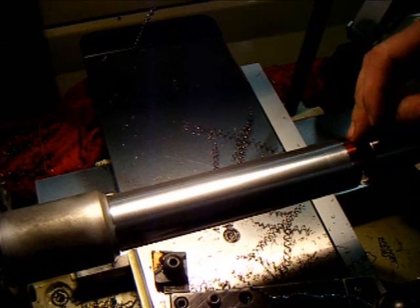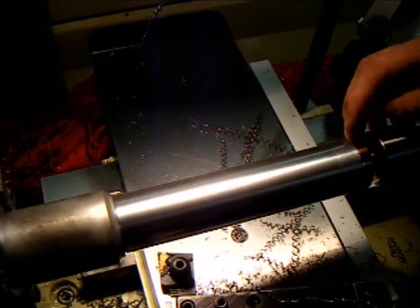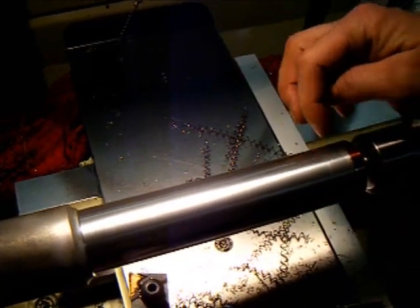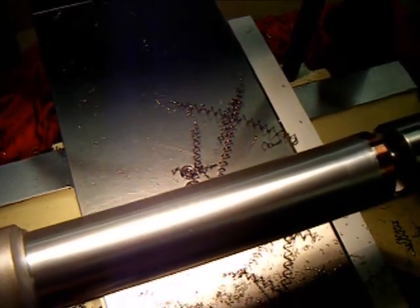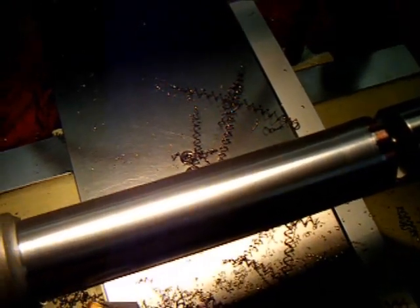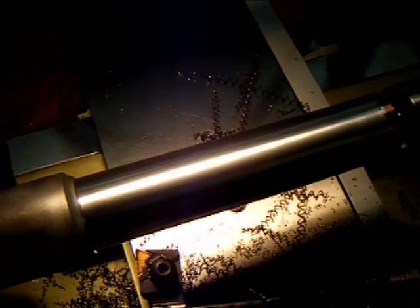The tip gears are roughly mid-50s to high-50s Rockwell C, and you're transitioning through the weld into 1045 steel, which is probably in the high-20s to low-30s Rockwell. So these are three different materials you're actually cutting as you're feeding the angle by hand with the compound — still gives a nice finish and a nice transition to the power feed.